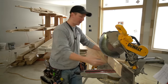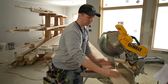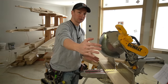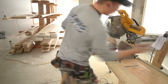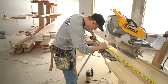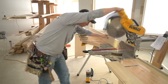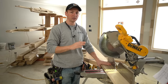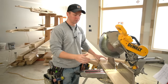The disadvantage to cutting on the flat is what happens to my frame of reference. Now my reference is only the length of both sides of the fence on my saw — so I can have an eight-foot length of reference cutting vertically, but cutting on the flat I only have about a 12-inch frame of reference. So if the piece of baseboard has a big crown or dip in it, there's a good chance that cut is going to end up being a couple degrees off, not 100% accurate. Doesn't mean it can't be done — I cut baseboard on the flat with a Festool Kapex for years and it works just fine — but this is one of the advantages of cutting vertically.